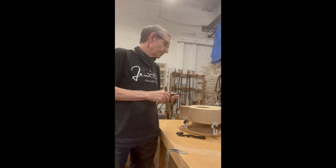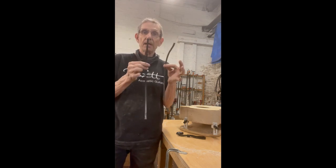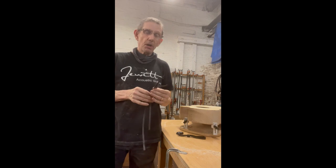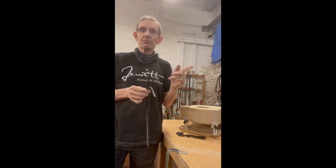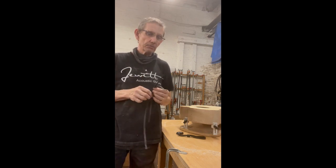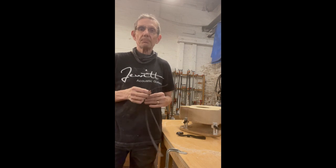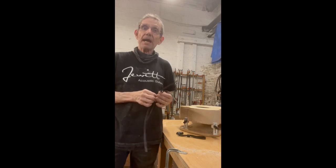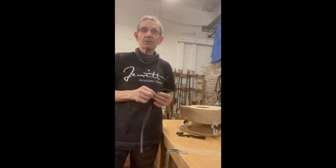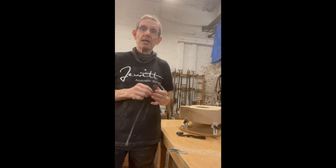Now, in the process of doing all that binding cutting with the router, I managed to break one of the binding strips. What I normally do, or I would tell people to do, is always make yourself an extra one or two binding strips, because this is the type of thing that can happen. I didn't do that though. I thought I would be frugal and save a few bucks by only bending four. So I might as well use this chance to show you how to bend binding. Normally, or at least when I did it with this one, I bent it with the sides. But if you don't do that and you just have to bend some binding without the sides, I want to show you how to do it.